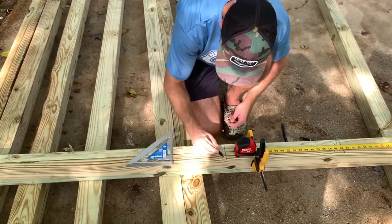After nailing through one side of the header, I simply flipped the header over and nailed in the other side to make sure it was perfectly secure. After constructing a larger 9 foot 9 inch header for the entire front wall of the shed, I moved over and created the smaller header for over the roll-up door.